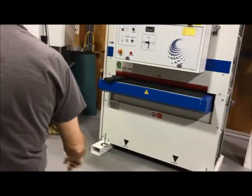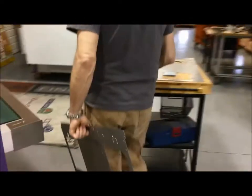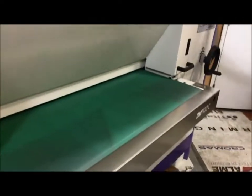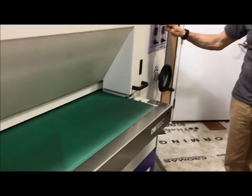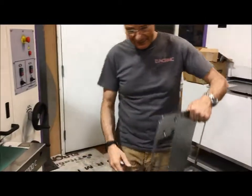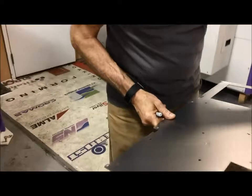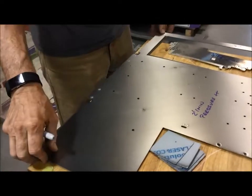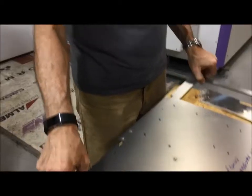If you would go onto a wide belt sanding machine like this one, of course, you would remove all the material. In order to turn the machine off, you just hit this one button, because we cannot run the conveyor belt without running the cross belts, and that is so that you do not bend the cross belts over if you run something that is too thick in the machine without the cross belt running. When the brushes are running, they will always skip on the material.